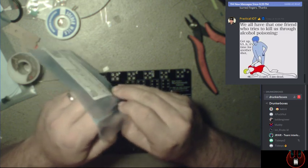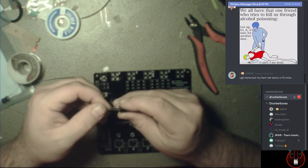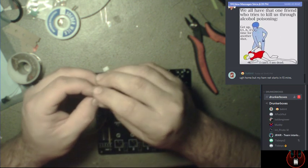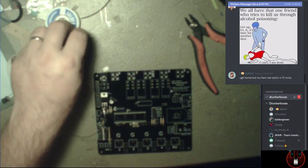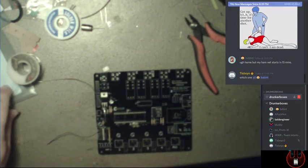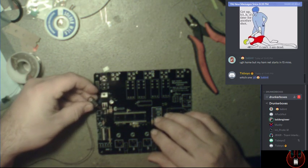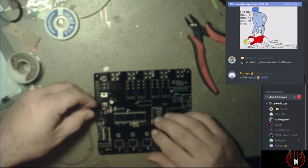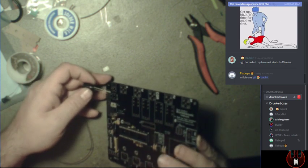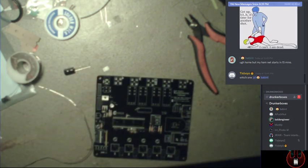Oh, and putting vias under pads is interesting because the solder paste goes through the via. Yeah, that's a terrible idea unless you really know what you're doing. Oh, putting vias on their pads? Mm-hmm. You'll do it once because you don't think about it. You're like, oh, I'll just connect this ground right through this pad. That screws things up. Where you get really hurt is when there's a ground pad on the bottom of, say, a switching regulator, and you connect this ground to the other ground through vias so that they're all connected together, and you get the heat sink. Yeah, that chip's not going to work.